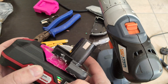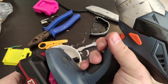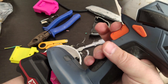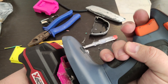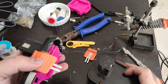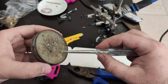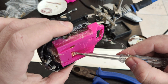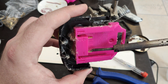It fits well so I'm ready to test the battery. It works pretty well, and you should check the battery regularly because some drills won't have an indicator that you need to recharge. Then I have a problem — it doesn't work so well. I plug it in and nothing happens. I figured out the problem: the terminals were not long enough and were not touching the terminals inside the battery as they should have.